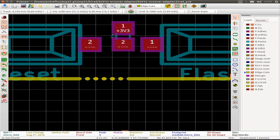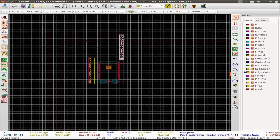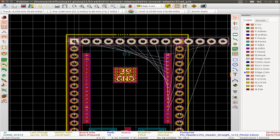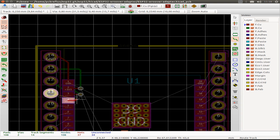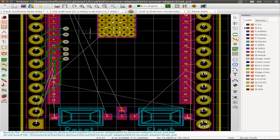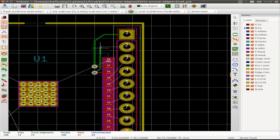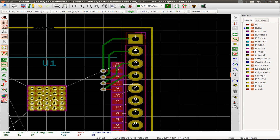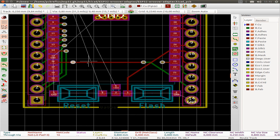We just have to order a large PCB with different modules on maybe a 100x100mm board — that's pretty standard with PCB manufacturers in China. After placement is done we start routing. The spacing between the pin headers and module is very small, so most wires go to the back side of the board where we can route everything in the middle and connect through the board — vias to the back side where wires reach the pin headers. Sometimes it fits on the front side but most wires go to the back. We also connect the switches.